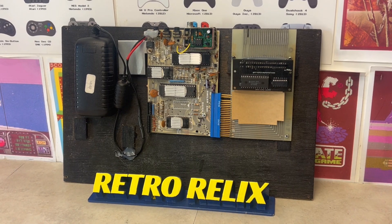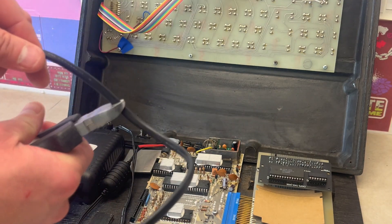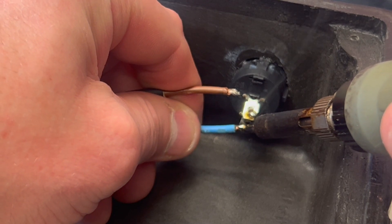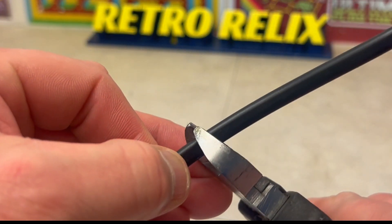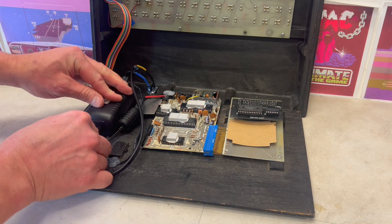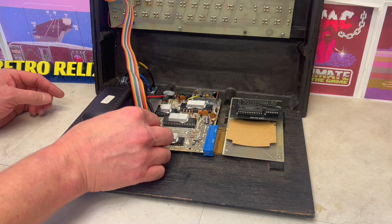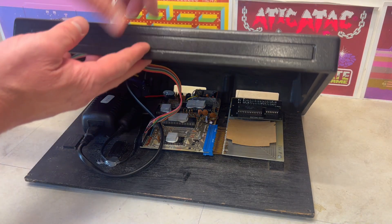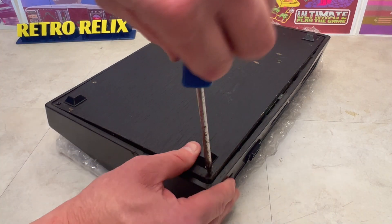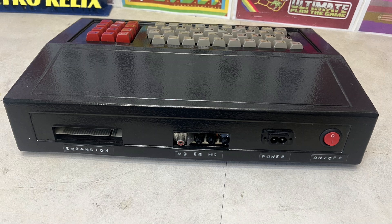This project is looking great. Measuring and trimming the internal power cable, and preparing for soldering to the on-off switch, and further cabling to the power input. Securing the joints with plenty of hot glue, it was now time to connect up the internal power supply and the two keyboard ribbons. Carefully closing it up, securing the base to the lid, and applying period-correct interface labelling.